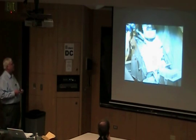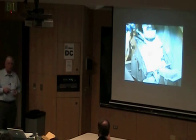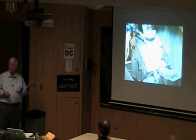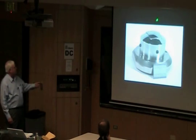But it's worth mentioning that in grinding the components for this was the tool for the mirror, wasn't it? By this time, we weren't using a spherical tool anymore. It was toroidal for a variety of reasons. You make it bigger, it wears slower. Anyway, when you grind a thing like this, you make a lot of passes. You get to something you can shine up without too much trouble and mold. And that's the way it was used. Where it's pushed up just enough so you can see it. It was flush when it was being polished.